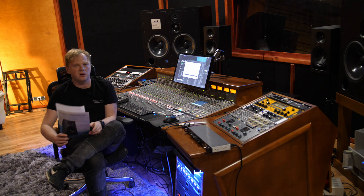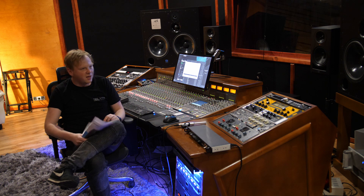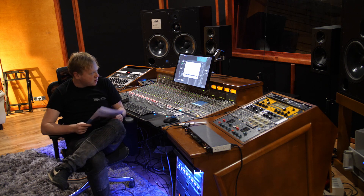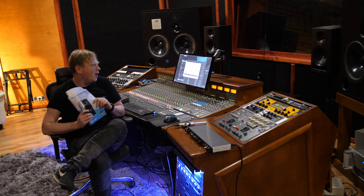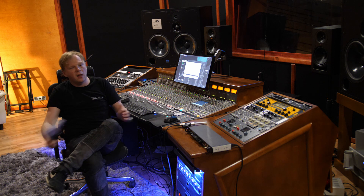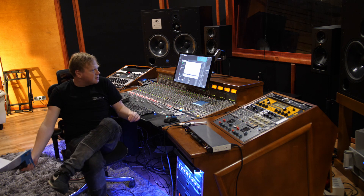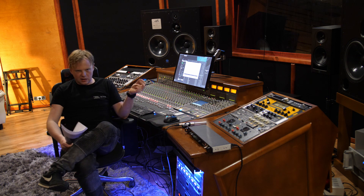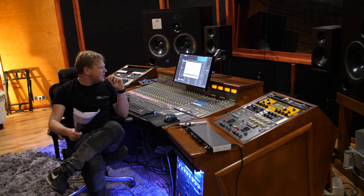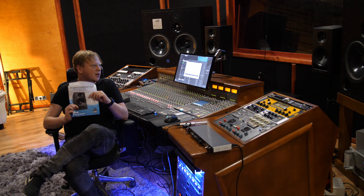We also have to remember that there are a lot of tweaks you can do with the built-in DSP processor. The average measurement was done with the DSP on and set for this room, while the FFT was performed with the DSP off. There's also a choice of software on the market to calibrate monitor systems — one of the most popular is Reference 4 by Sonarworks. I used the measuring module from this program to measure the average frequency response of both sets, taking an average from 40 measurements per speaker, then generating a dedicated calibration profile to compensate the characteristics of your room and monitors. So we have a lot of tools to compensate these bumps in frequency response. But generally, as a starting point, the IN8 is very, very good — not to say great. A three-way monitor with an 8-inch woofer and such impressive specs at this price point doesn't happen very often.